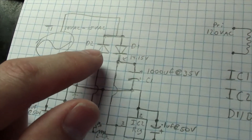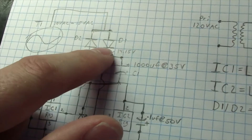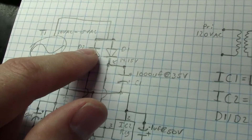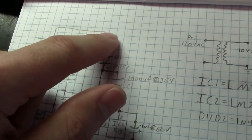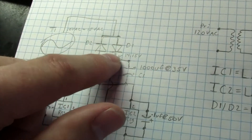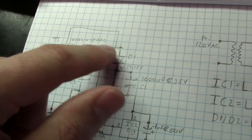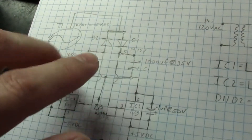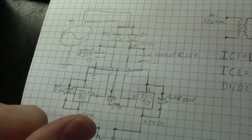This allows you to have a negative and a positive output. The cathode is the little line which represents the negative side, and the anode is the positive. You can see this one has the cathode facing this way. Since this is a sine wave input, wherever there's a positive slope that's your positive voltage — it'll actually flow through this diode. When it cycles negative it'll flow through this diode. If the input is negative up here it will be blocked by this diode, so only the positive slope comes through one diode and the negative slope through the other.